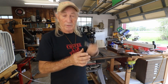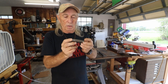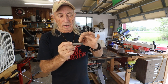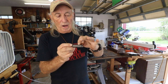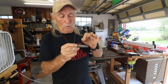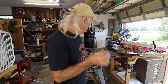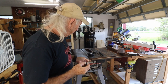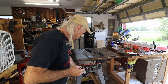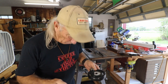The other end of it, for the adapter, I got some 3/8 black pipe from Lowe's or Home Depot — just a little piece, a couple inches long, a couple dollars. I'll cut this off and take it to where I'm going to drill a tap and die hole — probably quarter-20, or maybe quarter-28 if I get really sophisticated — and put a nice little set screw in here so that can lock to the original shaft, and then weld the other end to the half-inch piece. So we'll be coming a couple of inches out, that'll put the wheel probably a good two or three inches further out. I'm not sure how all this is going to work, and I was going to film it today and just go through the steps with you guys.